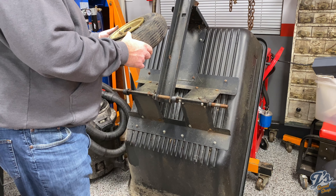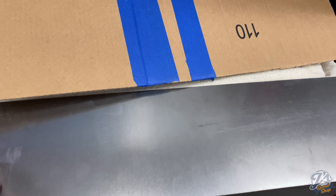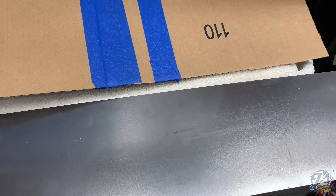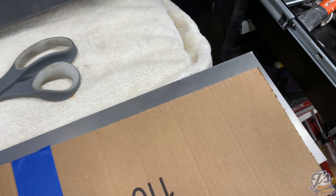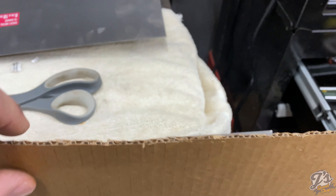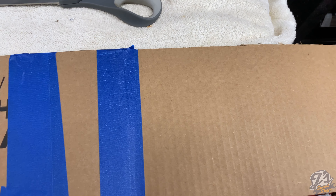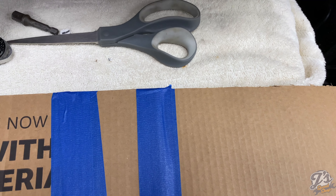We'll clean up the axles and first I'll make sure I can get tires for it. To patch the mower deck, I got a sheet of 22 gauge, 6 by 24 inch steel from Home Depot. I'll definitely need another sheet because this will only do one side. What I did is make a cardboard template - taped two pieces together and cut them to size. As it goes around the mower deck, it'll make a curve, and as you fold it over the curve around the top, it'll have to be cut a little bit. I also got a piece of 16 gauge - it's a lot thicker and harder to bend, but it's probably closer to the right gauge.